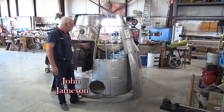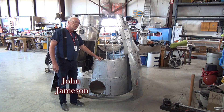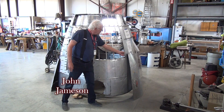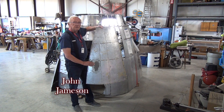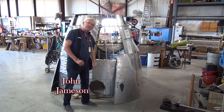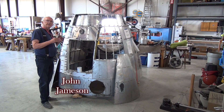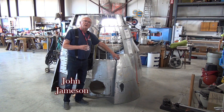We're only replacing the ribs that are in quite rough shape, as these ones were corroded out in a number of spots. This one isn't so bad, so we'll be cleaning it up and preparing it for priming and painting. Some of these skins are a little care-worn — it's normally on the bottom of the aircraft where water sits and eats up the metal. We're making pieces as we go along — it's just like a great big puzzle. You do one little section at a time, and once it meets all the surrounding pieces you know it's in the right shape and place.